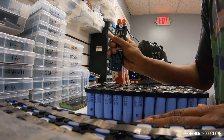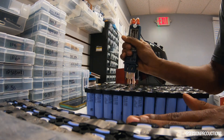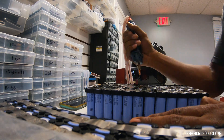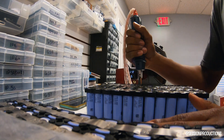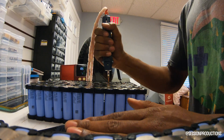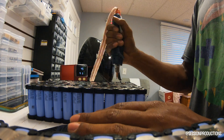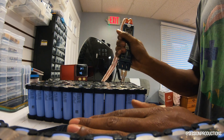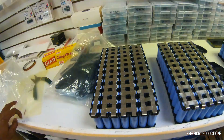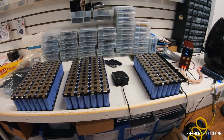I'm laying down the nickel strips — as you guys can see, I spot welded each row, each series of rows, one row at a time, and then just keep going. I did both sides and then I worked on my parallel connections. This is what you're seeing right now: the parallel connections. Going down each spot, I think there are 11 strips I have to spot weld down.